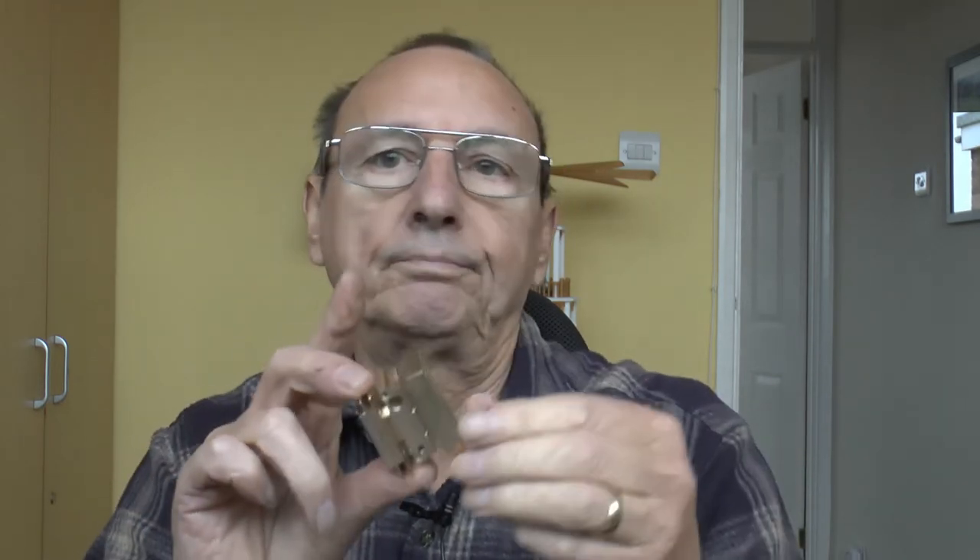I'm looking forward to testing this. The idea is to try and run it even cooler and still extrude reliably. I'm also going to use an 80 watt heater — it sounds bizarre after all this work to stop it getting too hot, but because it's brass it takes longer to heat up. When I first want to start a print and it's got to reach 170 degrees or so, I don't want to wait forever. Once the hot end is up to temperature, that secondary heater won't do much — it's just for the initial heat-up so I don't have to wait 20 minutes.